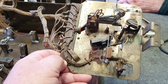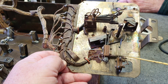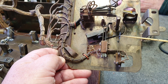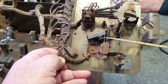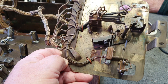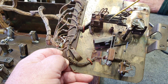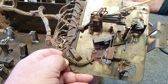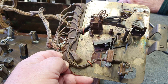There are three separate stacks of switches. This switch here is always the lock-in switch — a normally closed switch that opens at end of stroke with the score reel. There's another switch on its own on a different level of the cam, and then we have the zero and the nine carryover switch to the next reel. Remember: on these games, for one thousand points you don't have a score reel — you'll have a light.